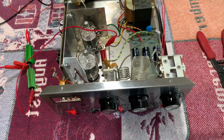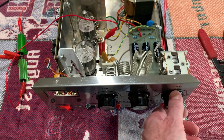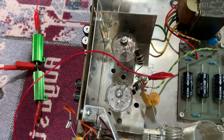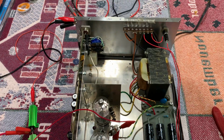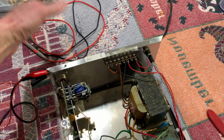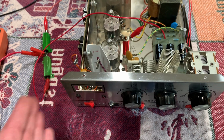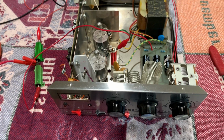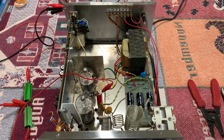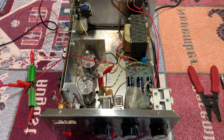But with today's higher line voltages, this thing should probably do 100 watts easy, but you don't want to run it that high. You're supposed to adjust the load. You're not supposed to run this any more than 90 watts out on 10 meters. That's what it says. Matter of fact, on all the bands with this pair of tubes in here. So we'll see what happens. And I have that Dimco CM1 linear amplifier Pi Network input tuner that I'm going to put in line with this, which will make the power come up anyway. So I'm probably going to want to use this swinger mode, and I'll back it down to where it'll bounce up a little bit when I talk, so it never drops backwards during modulation. So that'll be good. So we'll see what happens when I get the bias adjusted, and I take it downstairs and see if the power comes out of it like it's supposed to, and see if the receive preamp works now. I do hear the relay click, so that's a good sign. So that's all I have for now.